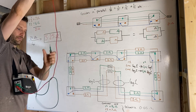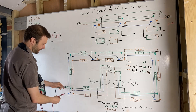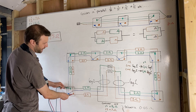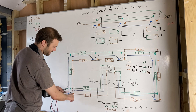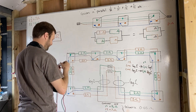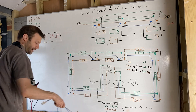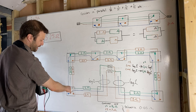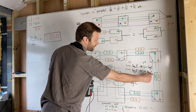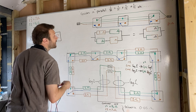Starting at the first socket, I put my testers between line and earth — R1 and R2 — and I get a resistance reading. Part of the electrons go this way: one ohm resistance going forward. As the electron flow goes through that circuit it then goes on through R2: two, four, six, eight, ten, twelve ohms before coming back to this point. So I record 12 ohms up here.